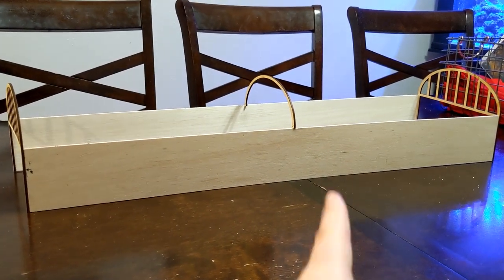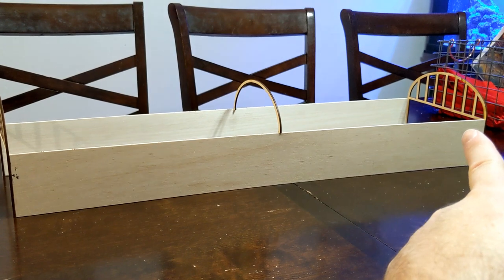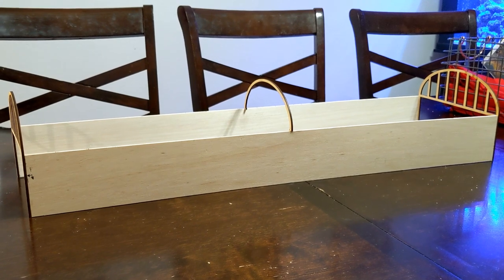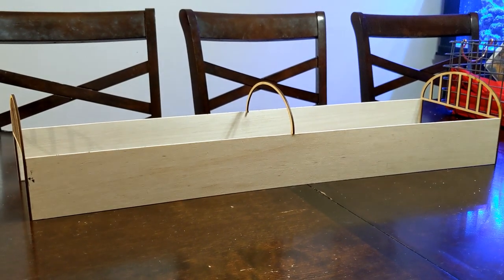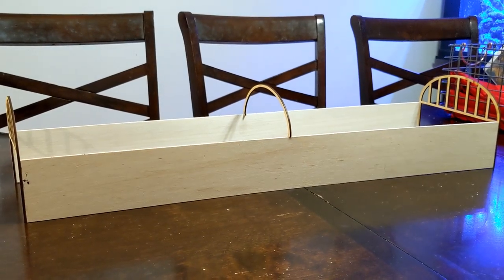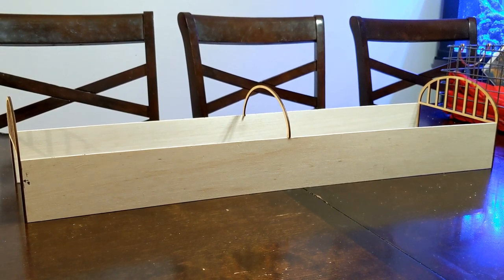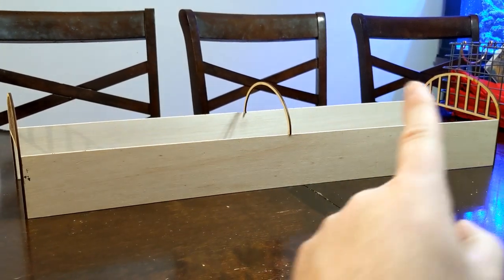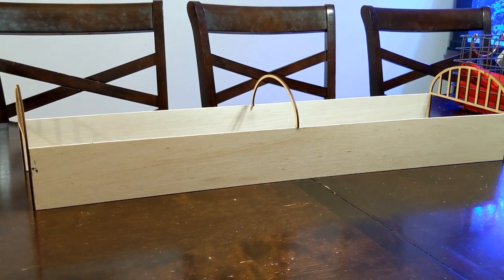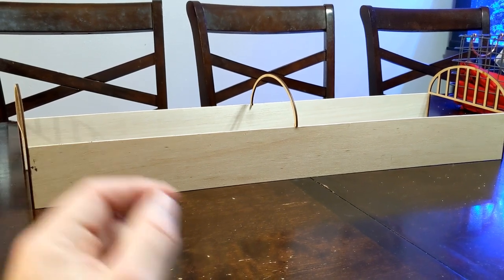But my idea is that I'm probably going to laser cut another 3 or 4 of these and kind of space them out. If I was doing them every 1.5 inches, I would have 20 of these. That's kind of a lot of these to put in place. And I don't think that the roof is really going to weigh all that much, but what I would like is to have probably 4 or 5 of these in place, and then I think that would be enough that I know I would then have a consistent height all the way across, and then the other ones in between maybe wouldn't need to be laser cut. They could just be thin strips that I could put on one end, go over to get the right curvature, and then cut them.